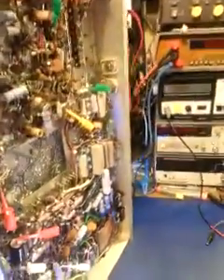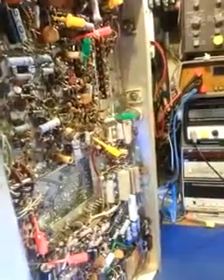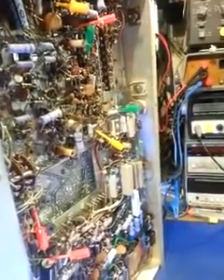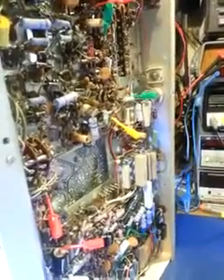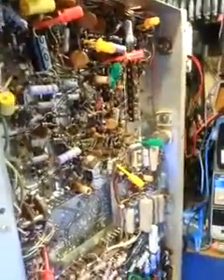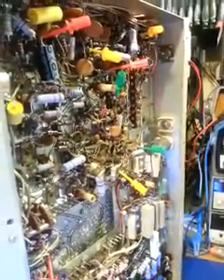So there's that annoying hum. I'm going to go through and run separate connections because these all use riveted connections with a star washer, so it's got to be either one or several of those ones that I've flagged — basically the little test clips there — that are causing this hum. So I'll return to fix this later.